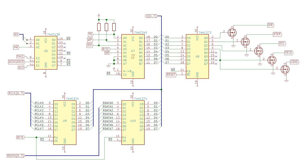I'll probably actually use 74HC574 flip-flops instead of 374s, but I put 374s on the diagram because that's what KiCad has the symbol for. The only real difference is the order of the pins, which is a little bit more sane on the 574s. So let's go and make these changes on the breadboard and get this circuit connected up to my old floppy disk controller circuit.